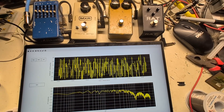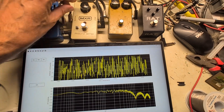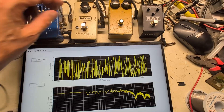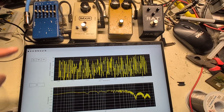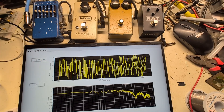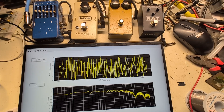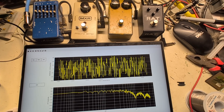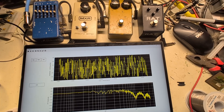Switching to the modded Microamp configured as a Distortion Plus, it's nowhere near as distorted. We're only getting odd harmonics because there just isn't enough gain coming out of the 741 chip, plus it's running a 24-volt power rail making it very hard to clip. It has distortion, but I designed it more to drive something like a JCM 800 just a little harder — creating that extra edge.